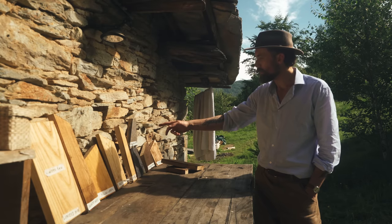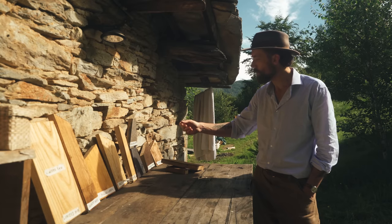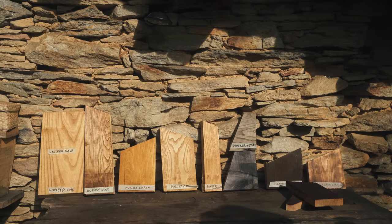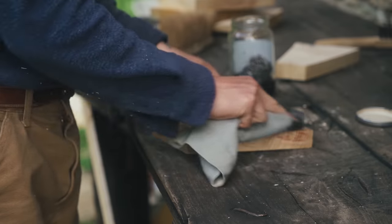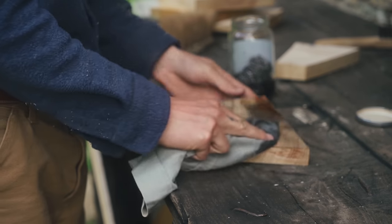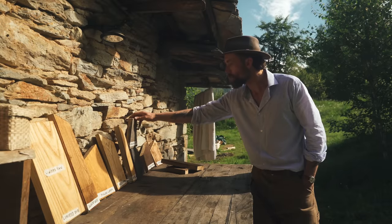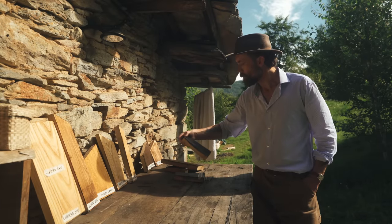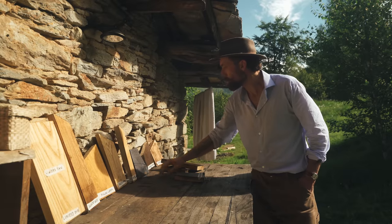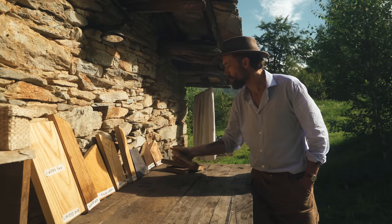the mix of vinegar and steel wool, which is a reaction with the wood, so you get this kind of grayish look, which turned out actually quite blue. And it's quite different depending on how long you put the steel wool and the vinegar together. I think this was 6 hours and this one a lot more, so it turns out quite dark blue. Almost looks burnt, but way more blue than this one. And this is a bit more subtle.